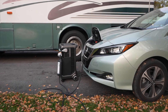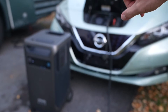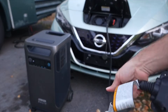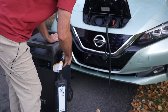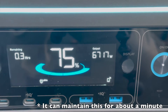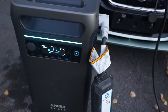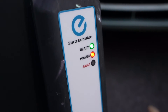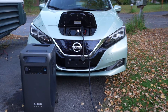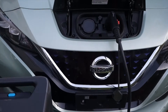I still didn't see over 6,000 watts on the screen, so I invited my friend over who has something that takes 240 volts directly. The Solex F3800 can also charge an electric car — he was gracious to let me borrow it for this test. It has a 50-amp plug to charge the batteries. Take a look at that output: 6,700 watts. It shut off because his charger was drawing about 27.5 amps, which is over the 6,000-watt continuous limit. If we had an adjustable charger, we could lower it to 25 amps or less and it would charge the car just fine. It is impressive that the F3800 can run that long at 6,700 watts, and if needed it can output up to 9,000 watts for 10 seconds.